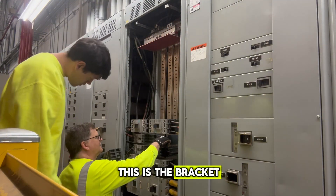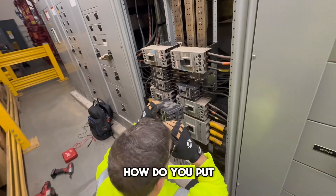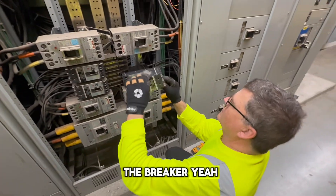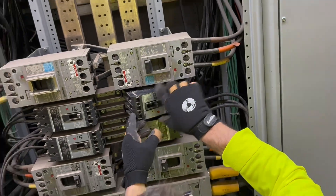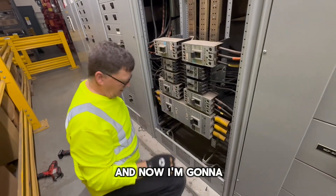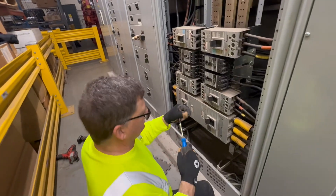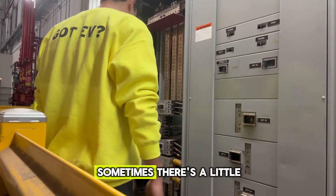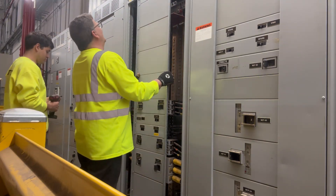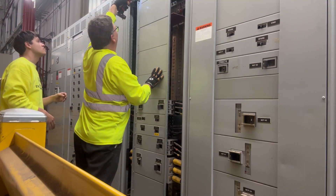See this little spot — this is the Z bracket. See how it fits into these little slots? There are three slots. The Z bracket here aligns to these little indents in the breaker. Align that in, then align it into the bus. Now take the screws — nut driver here. Put in the bottom, then line it up to the breakers. You can use the drill now — I have a three-eighths nut driver.